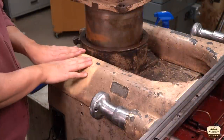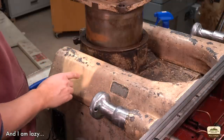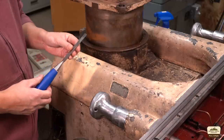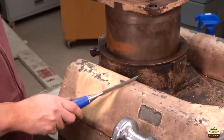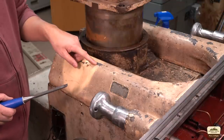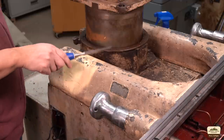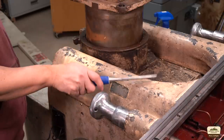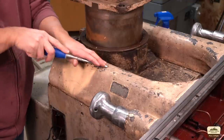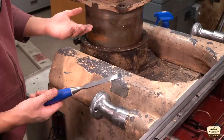Now I'm going through and assessing the condition of the paint. I'm not going to strip it completely — that's just too much work — but I also don't want to paint over any loose chips. Here's a trick: take a wooden chisel, pick a side, and just go around tapping it. If it comes off when you tap then it's not going to last. If it doesn't chip, it'll be all right. Seems like right here it's pretty loose — the whole thing may end up coming off.